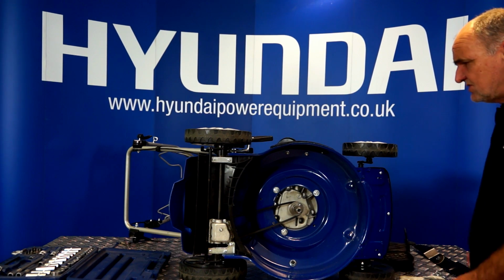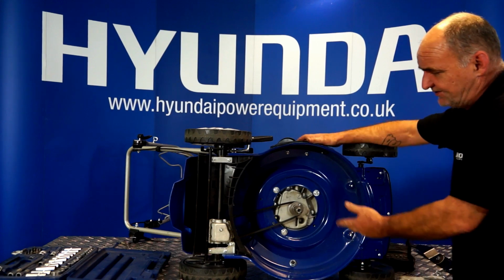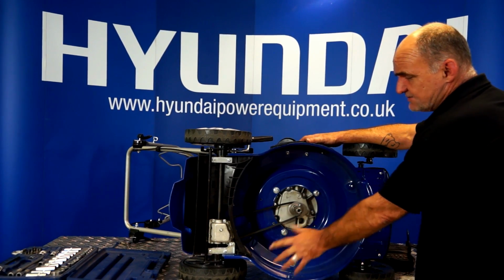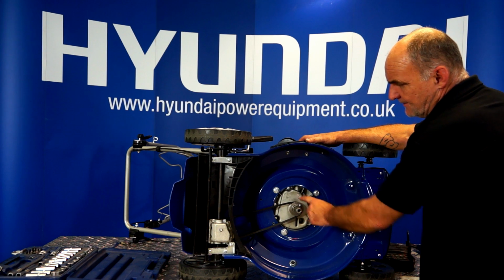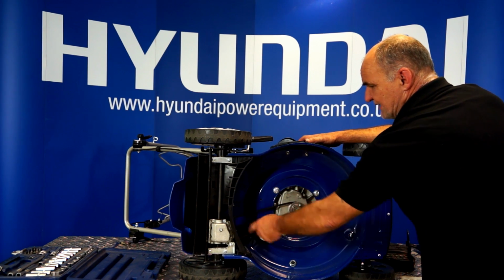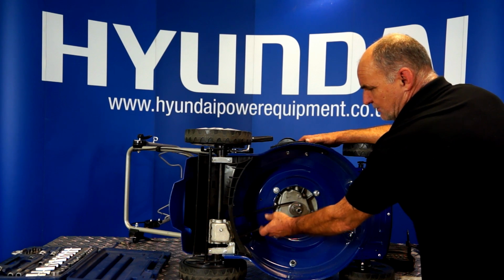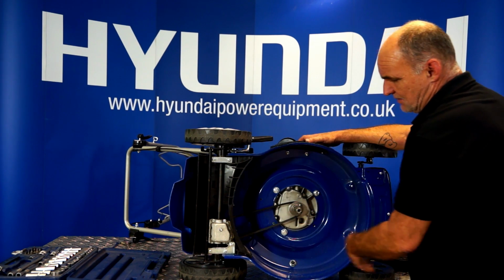So the first thing we're going to do is examine the belt carefully, looking for any breaks, cuts or what have you. Now this belt is actually on its pulleys, which is a good thing, which means that the belt sits in the groove in this pulley, and that the white pulley at the back here, you can see quite clearly it's sat in the groove there as well. Now this belt is in very good condition. I think it's a fairly new mower, hasn't had much use.